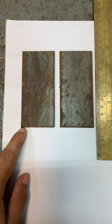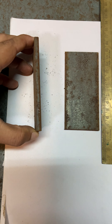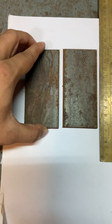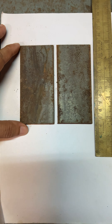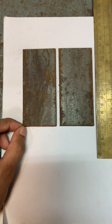The first operation is to polish all the edges to remove any type of rust. If rust is present, it will get into the welding pool and create a brittle weld pool joint, which is not desirable. So after we have the sheets of material, we first do the filing operation.